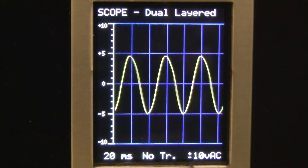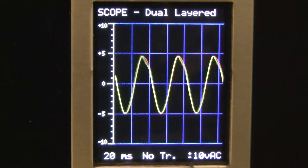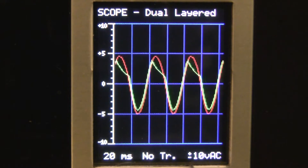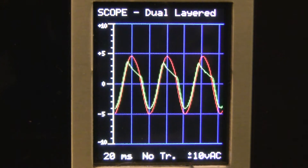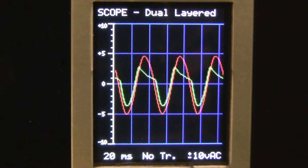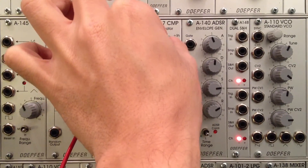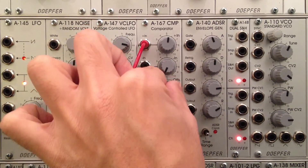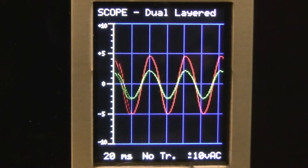Let's take a look at our oscilloscope as I'm applying the offset. We should see a little bit of a change. You can see it's kind of changing the shape. Now let me go back to my comparator and bring the level about halfway down, because you'll be able to visually see this a little bit better as I'm applying offset. My attenuator is bringing in 50% of the voltage at the plus input.